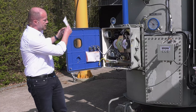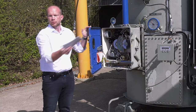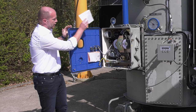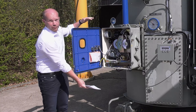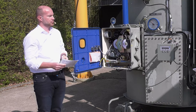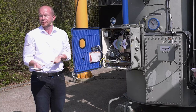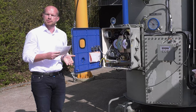Also, we need the mechanical design. Do we have to open the door to the left or to the right? Do we have enough space for the new motor drive unit? How does the drive shaft look like? Do we have to consider 1 meter like here, or perhaps an intermediate gear? This is really related to the OLTC.